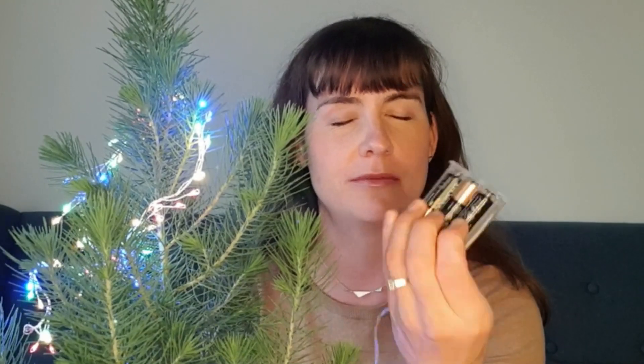For the electrical parts, I'm using this little string of colored LED lights. They normally take three double-A batteries, so that's 4.5 volts, and according to the box, 20 milliamps — so power equals current times voltage, that's about 90 milliwatts. But I do know from testing that they'll turn on somewhere between two and three volts, so they can make do with a little bit less power.